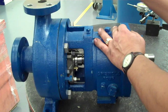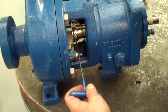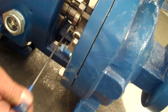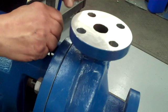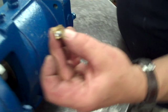Once you've got that done, there are set screws. We'll run those in and that'll mate up to the shaft. Once you get those tightened up enough, you can take out the safety clips. These clips you want to save in case you ever have to make any kind of adjustment. Put those back for safekeeping.